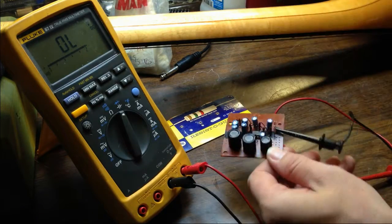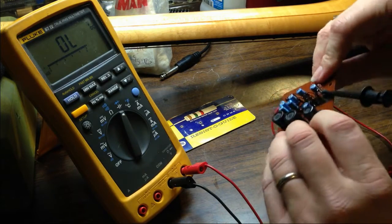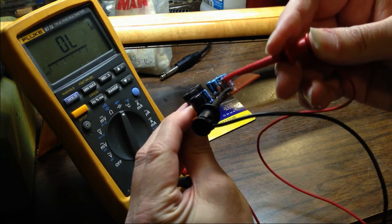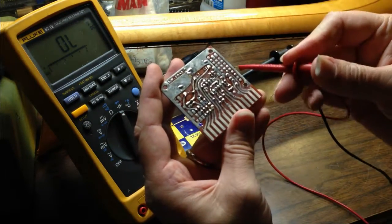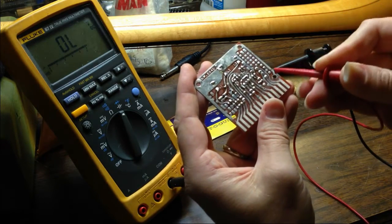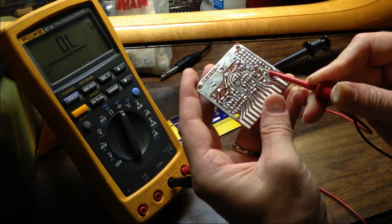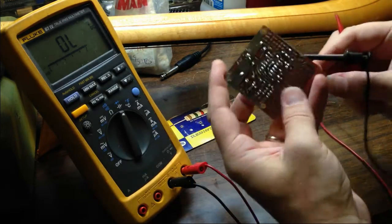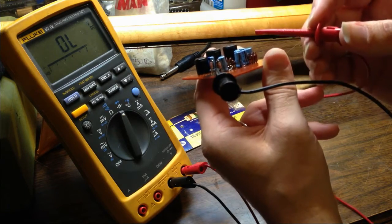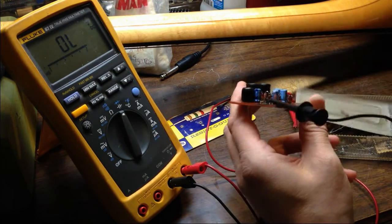Unfortunately, that did not fix the problem. So I'm going back through to see if there's anything I missed, and sure enough it looks like there are a couple of zener diodes right here on the edge of this board - two of them in fact. One of them tests okay at about half a volt, as you can see. The other one is open lead. I do not know how I missed that, but I did. So it wasn't the integrated circuit - it was actually this zener diode right here on the edge of the board. Let me pop that out and put a new zener diode in and see if that fixes the problem.